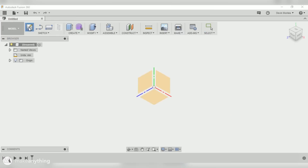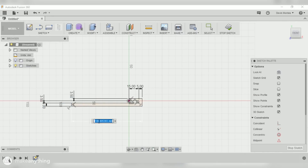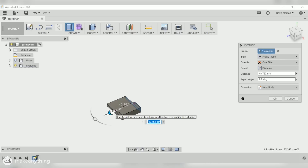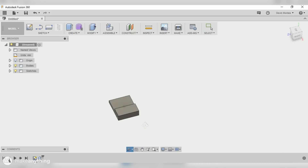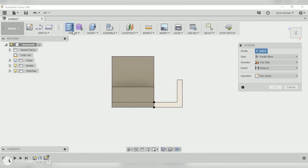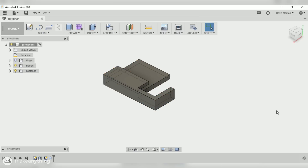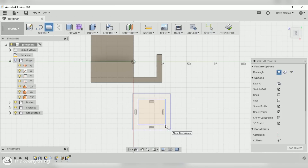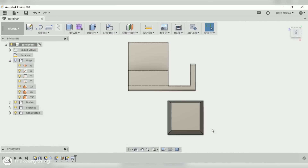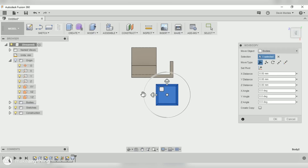Rather than figuring everything out on paper, I'm going to improvise in Fusion 360. I'm starting by drawing a little slot that'll hold on to the metal plate, and next to that a little U-shape that connects to the sensor part of the build plate — something to keep everything rigid. After that I'll model out the tripod mount portion, make it a little bigger for tolerance to slide in, and then subtract that from my model.